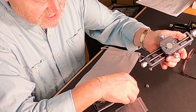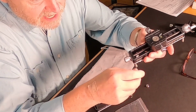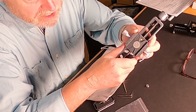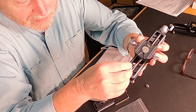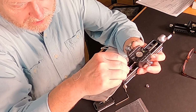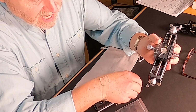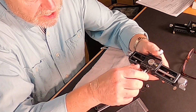So these Allen wrenches, what makes this so important is in the instance that you get yours and there is some play, there should be zero, none at all. If there is, it's a simple matter of putting this 2mm Allen wrench into the base of that hole, seating it in the screw and cinching it tight. That's it.